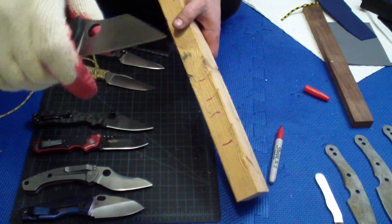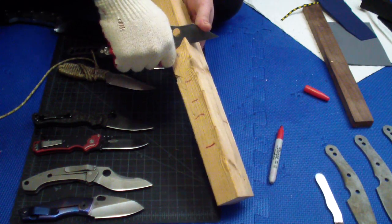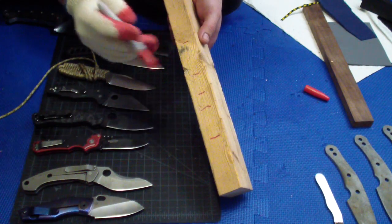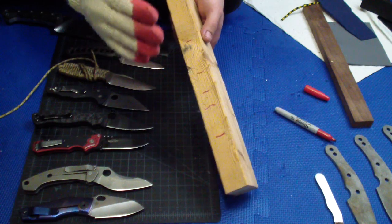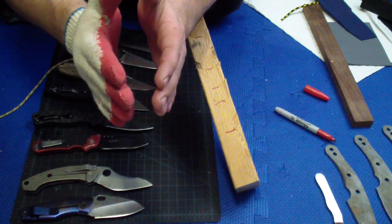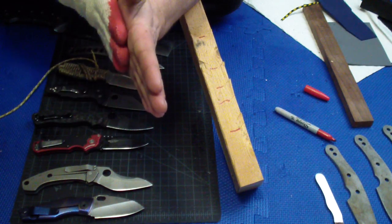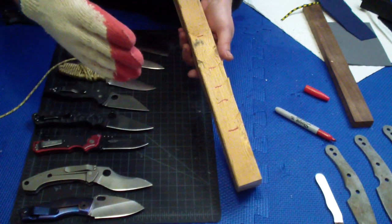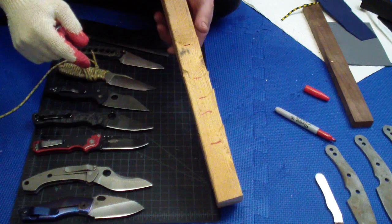It's an extremely good cutter. The only downside of this is that because it's flat, there is one difference, and that's the main difference between a good thin flat and a convex: the convex is going to be a little stronger, because of the slight radius, even though it is a microscopic radius compared to the flat. When you have a good lean grind, there is a very small difference from the flat to the convex. That little radius on the sides is not like a lot of drawings show. It's really microscopic. That little difference means the material you're cutting doesn't drag across the whole length of the grind. The little radius pushes the material away, so you are in contact only with the beginning of the edge, and then the material clears the back of the grind. That's the whole point of it. So that was the Yojimbo, pretty good.